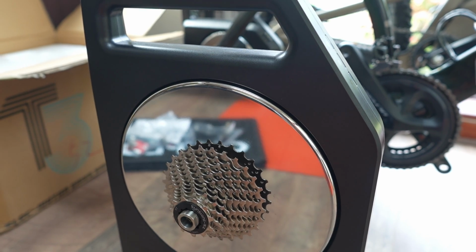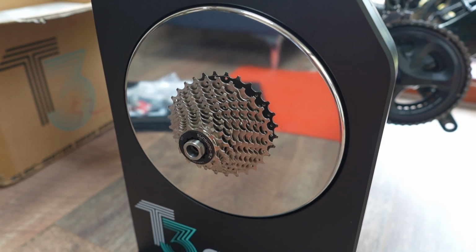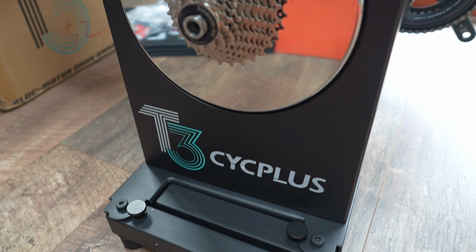So I'll leave that video link in the description or somewhere on the screen here. Looking at it side by side, it's got an absolutely massive motor. So the brushless DC motor is basically twice the diameter of the old one. So not only has it got bigger coils, it's got more thermal mass. If the diameter is double, it needs half the tangential force to provide the same braking to give the resistance.